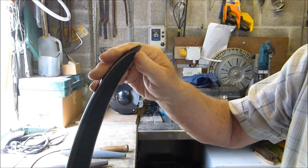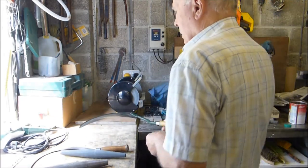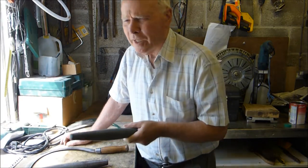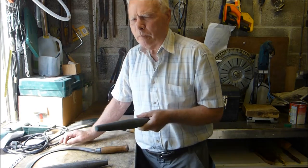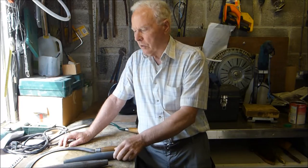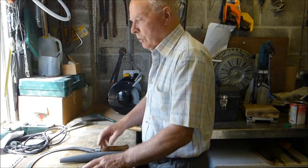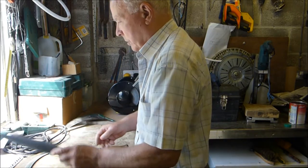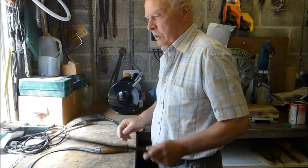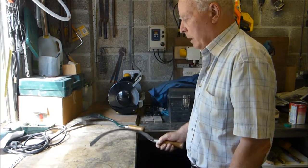Make sure you sharpen right to the end, especially at the tip, because that does a lot of the cutting. So that's the reason I recommend that stone — silicon carbide, made by Faithful. I think they're an American firm. They're about thirty centimetres long — about a foot — and that ought to suffice.